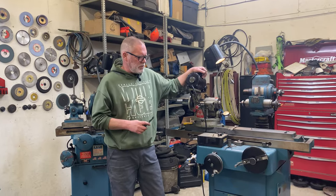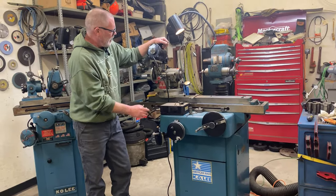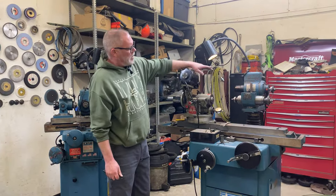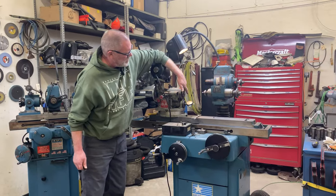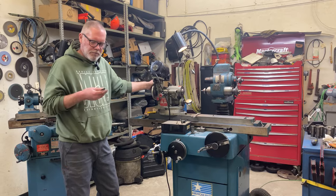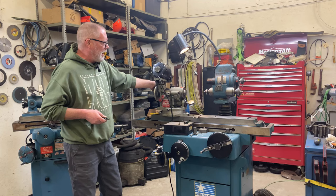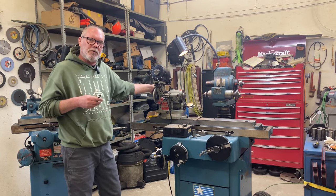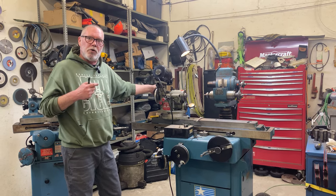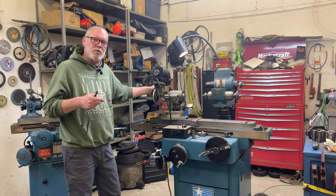We're going to be doing this work using our KOLE B2060 tool and cutter grinder and our Hybco two-way cam relieving fixture. I've already got my spindle at the same center height as my Hybco fixture. I put the two flute cam into the Hybco fixture because, of course, the drill bit has two flutes. So we're going to need that. Another thing that's super important: before you go trying to dial anything into this fixture, you have to choose your reliefs and set them. Otherwise, your dialing won't be accurate. And we'll explain more about that.